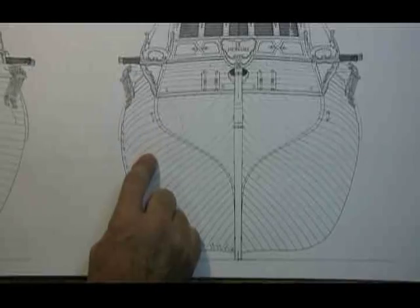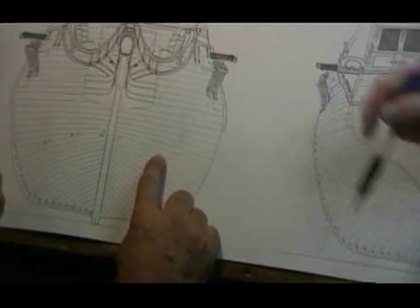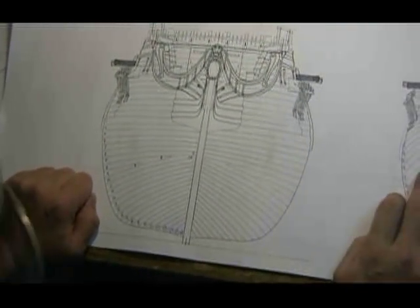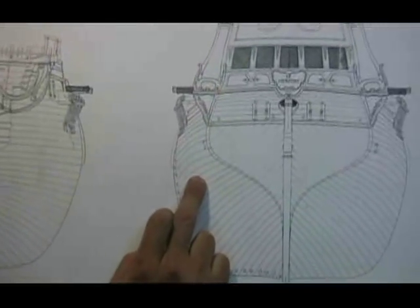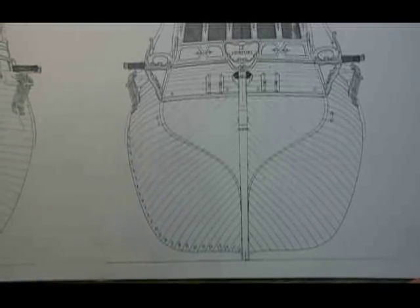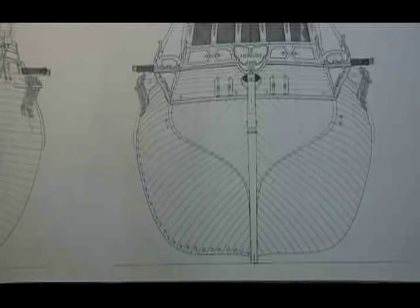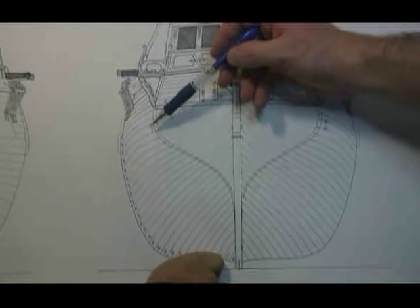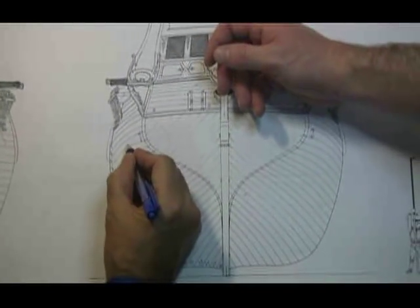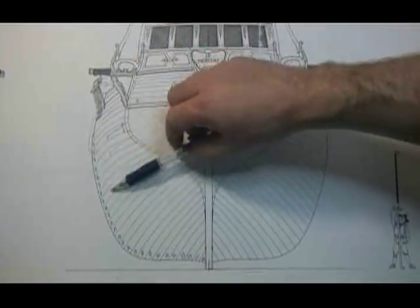That's why he considers that there must be a minimum of two lost planks here. You're referring to these planks? Yes. In Russian the word is потеряйка, from потерять, to lose in English. So are you talking about stealers? Stealers at the back? Yeah, stealers, there must be. And there are none here, so he thinks there's a problem.